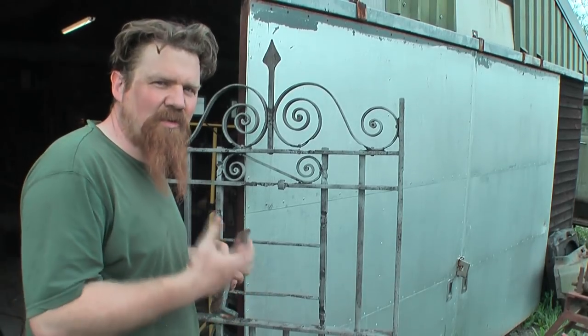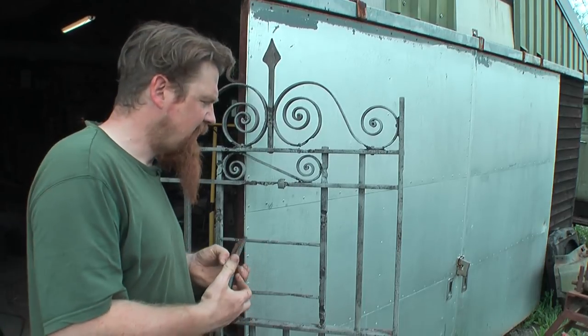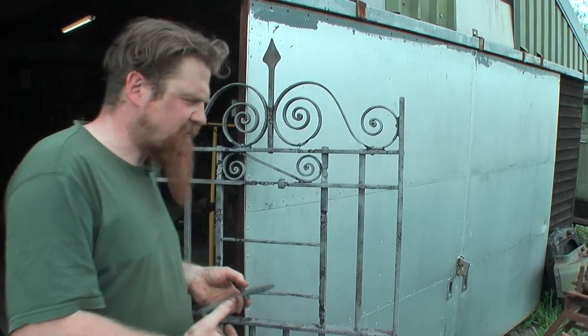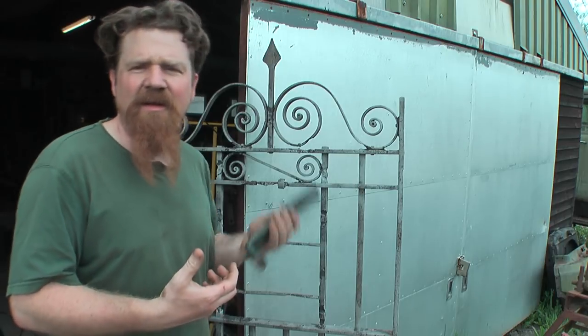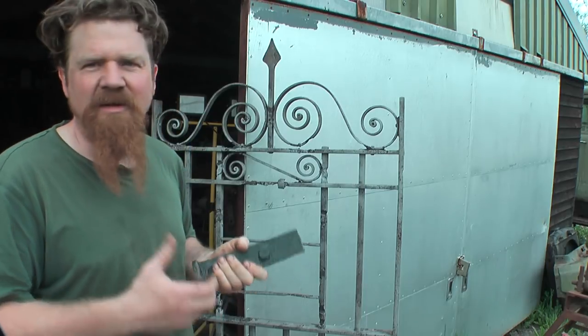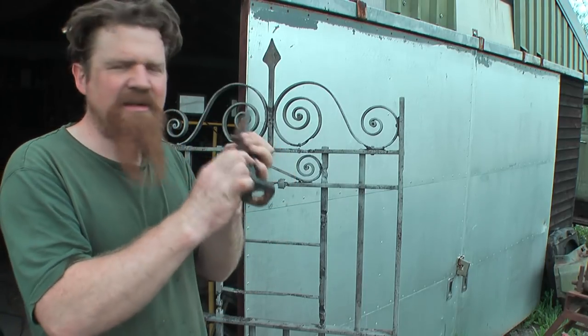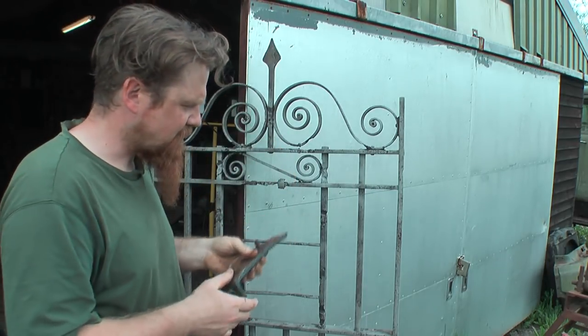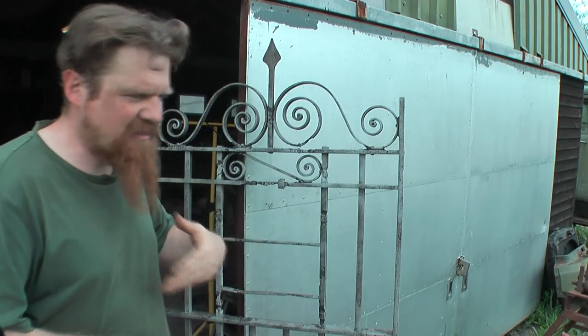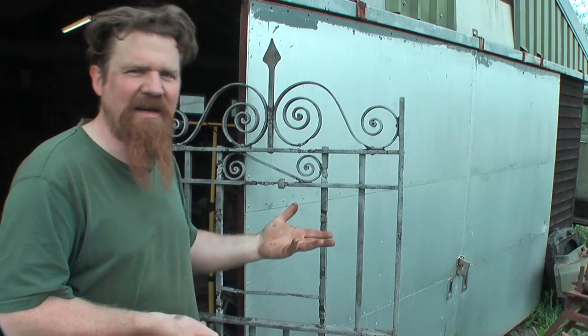It's interesting to note that all the steel that you buy nowadays is simply a metric version of the old imperial sizes. And by that I mean, when this was newly rolled, all this wrought iron, obviously that was imperial, like I say, 2 inch by 1/2 inch. But all the stuff, when it went to metric, just carried on being the same size, they just relabeled it.